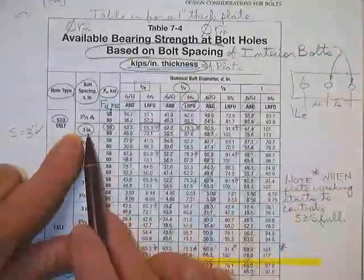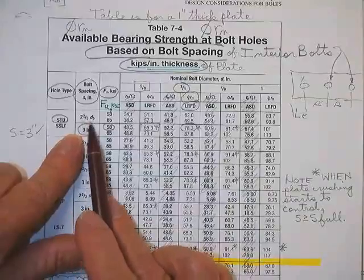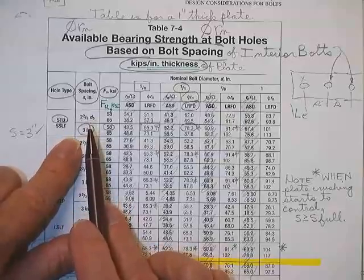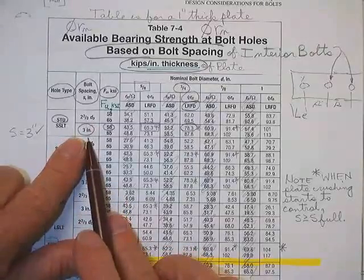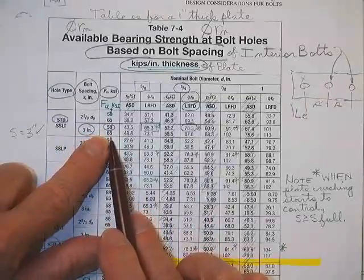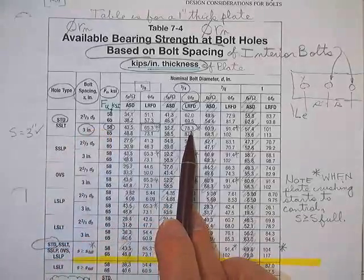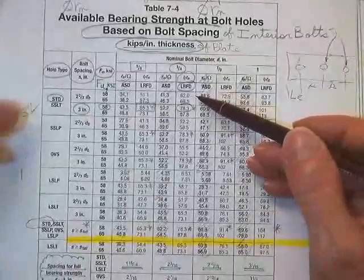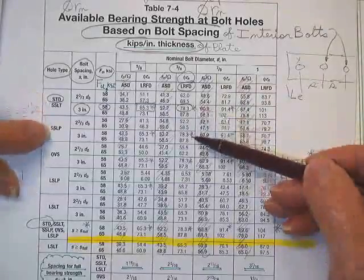Our bolts, they're either 3 inches, which is pretty common and recommended, permitted 2 2/3 times the diameter of the bolt, but you may have to have a discussion with the guy with a wrench or the lady with a wrench because that's getting it pretty close. Ours were 3 inches. They were 58 KSI or 65 KSI ultimate on the steel. That was 58 and 78.3.